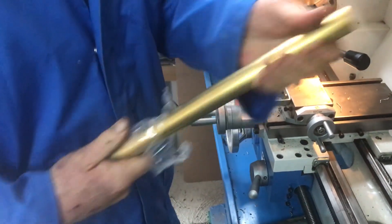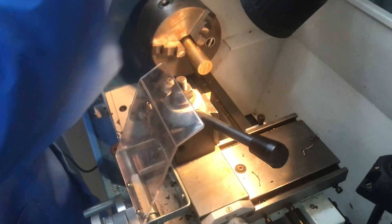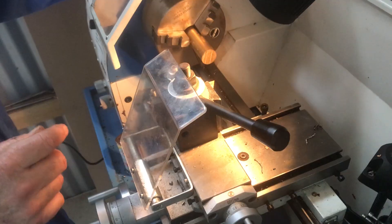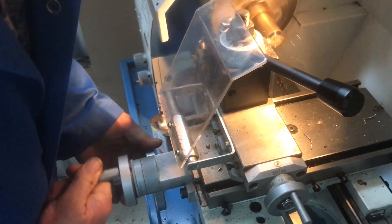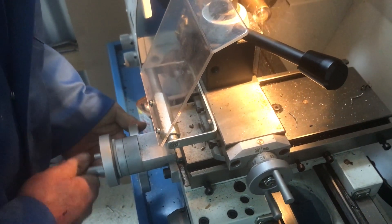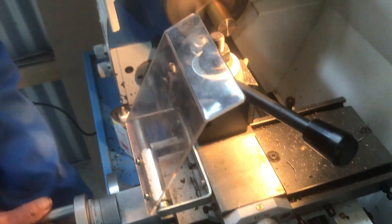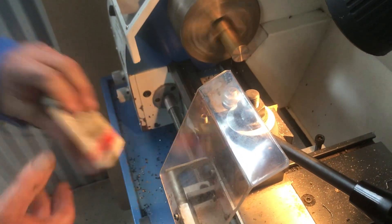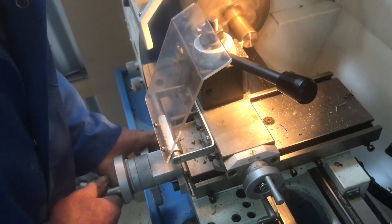I have a bit of brass, so I'll show you what happens with brass — same thing again. You can cut brass with these inserts, but you don't put coolant on it. Use just a little bit of tap magic. We're on the center height, we'll take another quick cut with brass. Brass is basically self-lubricating, so you don't need coolant, but place a little tap magic on the tip to stop tool build-up.